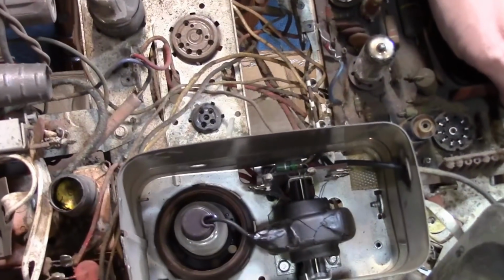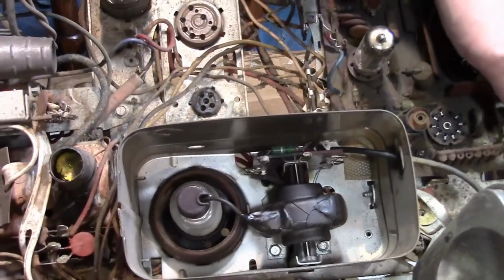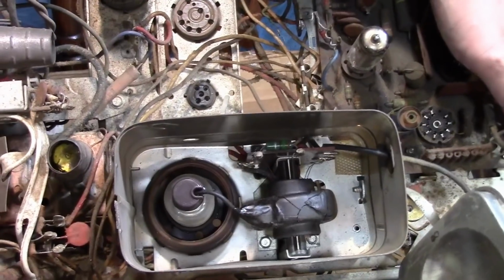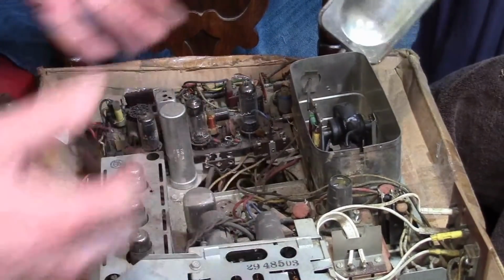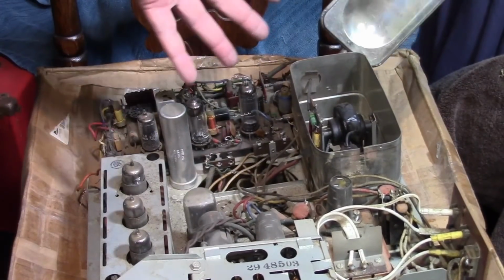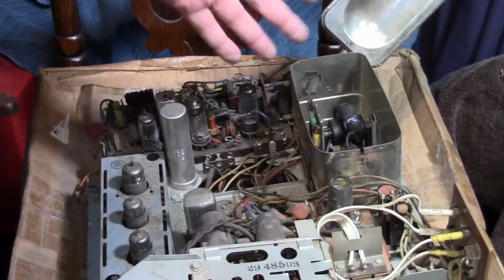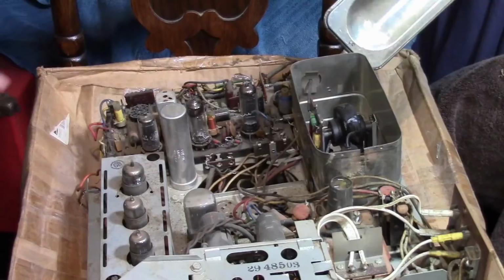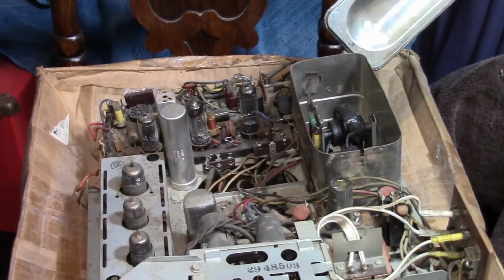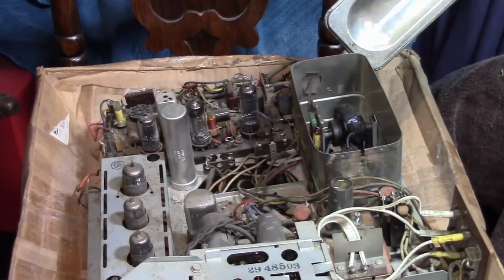And I know people love to rag on Predictas about them overheating and the flyback always failing, yada yada. Pretty much all late 50s TV flybacks look like that. That's a wax coating they put on them. Over time, they crack, and over time, some heat is generated, and there'll be a pool of wax underneath. Extremely common, nothing to do with Predicta design. Also doesn't mean they're bad.